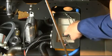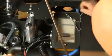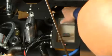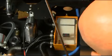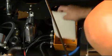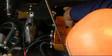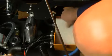The next item of service is your inline vac motor filter assembly. The assembly is designed to capture any type of debris before it enters your vac motor assemblies. To service, remove the two cotter pins as shown. Next, remove the clear sight port and filter plate assembly as demonstrated here. Next, inspect the filter assembly and clean or replace if needed. The filter assembly is equipped with an auto release valve that will clear any water that may enter this assembly area.